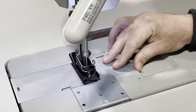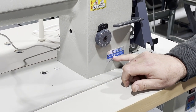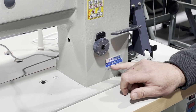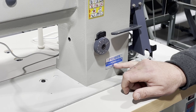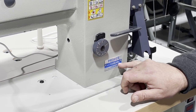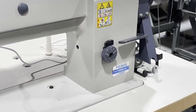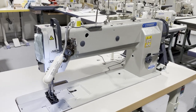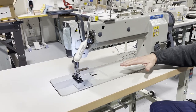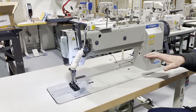When it comes to P1 — P stands for Premiere and 1 is just to change the item number — from 255RB they made it P1255RB. LH stands for long heavy-duty long handle, and 18-dash-1 is obviously 18 inch with one needle. They also make this in two needle, but this is a single needle 18-inch long neck flatbed top-load walking foot machine.